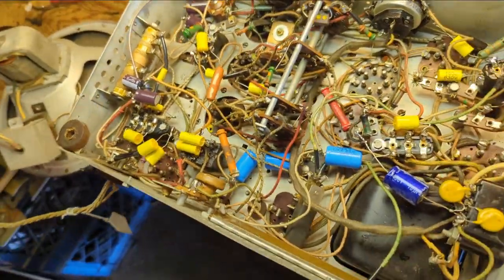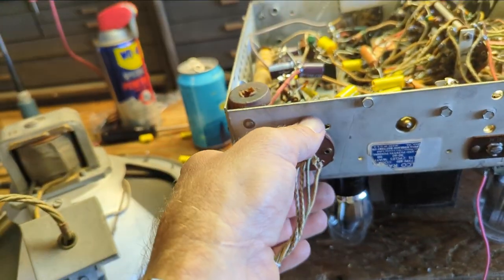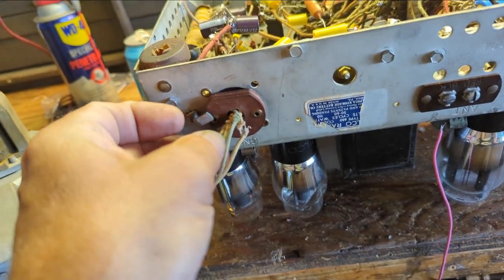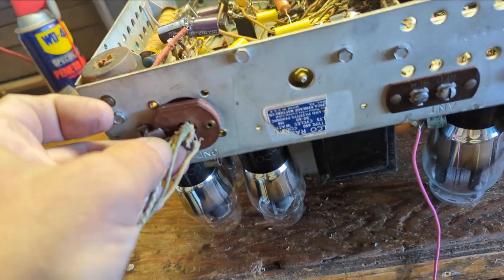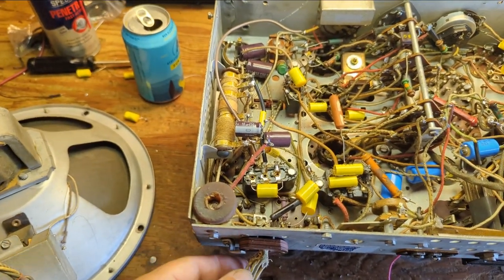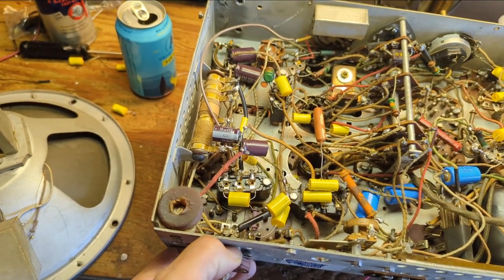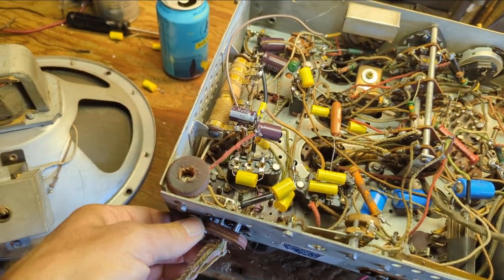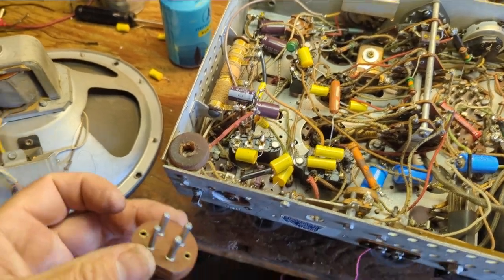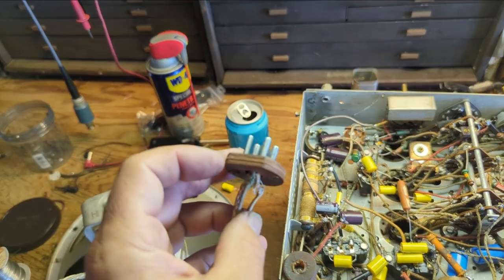There are a few things I need to do. Number one is the wires going to this plug are bare going into it. The problem is this whole plug is stamped together and held by rivets. I need to find a way to insulate this part — I'm going to get some electrical tape and make sure everything is completely insulated. You don't want B-plus on that uninsulated.